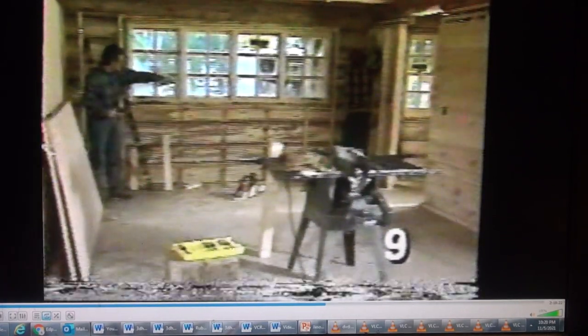You can't screw the cabinets directly into the logs because they do settle. Instead, we'll attach the cabinets to this plywood buffer that's attached to nailers, like you see right here, to remain stable as the logs settle. We have this wall done already - we'll show you how we do it on this wall here.